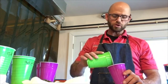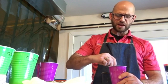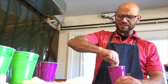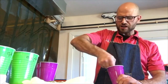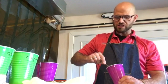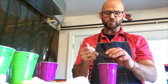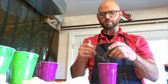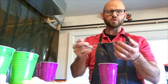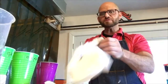So instead of 60 grams of water, I'm using half that amount — 30 grams. Using half the water creates a stronger and more durable concrete, but unfortunately we also create a concrete that is extremely dry, hard to use, and hard to consolidate. Let me get a scoop of it — instead of that fluid paste we had before, we have a very dense, stiff paste that requires a lot of mechanical vibration to consolidate, and worst case we can get bug-holing and honeycombing.